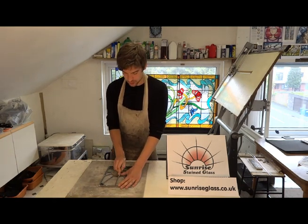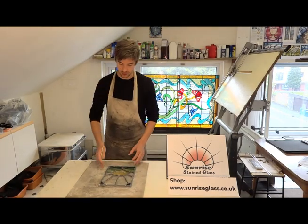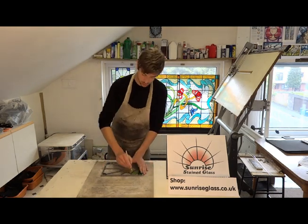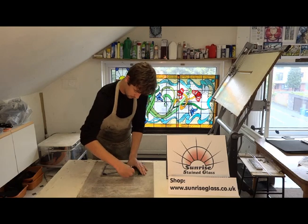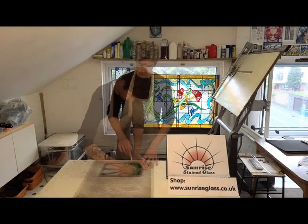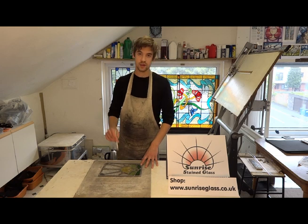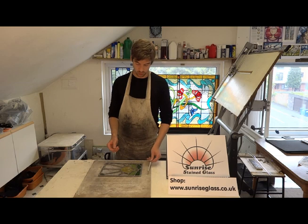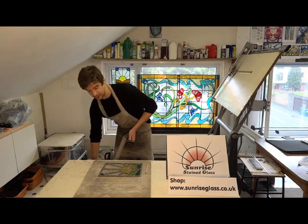If you leave your project too long between the last stage and this one, it'll be quite hard to get that off. So three days is probably the longest that you'd want to leave it. So I've gone around the edge of every piece of glass on one side now. I'm left with a lot of crumbled, dried up lead-lite cement, so I'm just going to use a vacuum cleaner to clean that up.